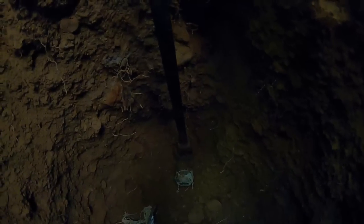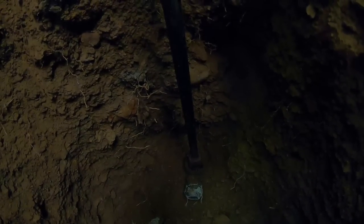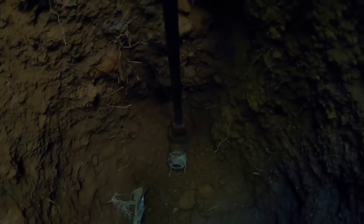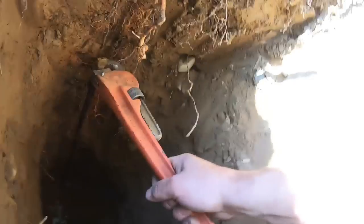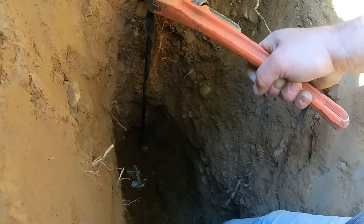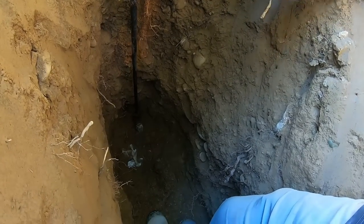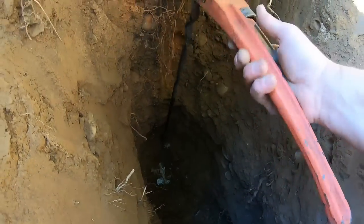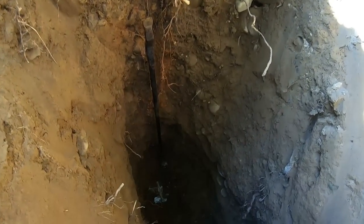When you spin that with the tool it goes on and off. If I turn to the left right now the water will come on. It's only held on by a cotter key. This is the nut — the compression fitting we've got to get off. That slips over the PEX, then we'll put it back on, three-quarter tighten it, and turn that on. I like to open this up just to run water in the hole a little bit and make sure it works before we go any further. I'm gonna pull that nut off.